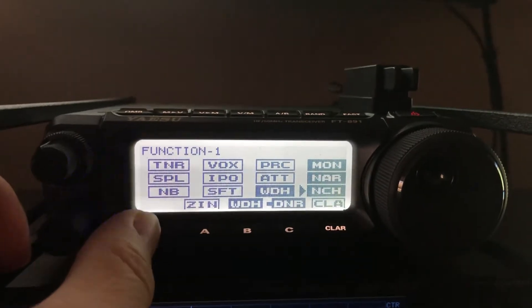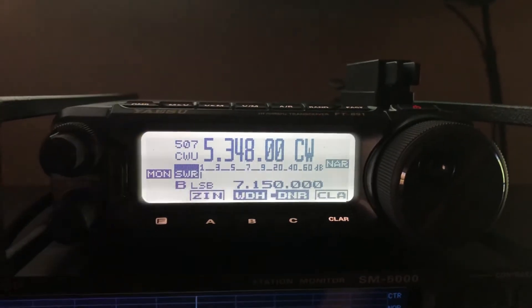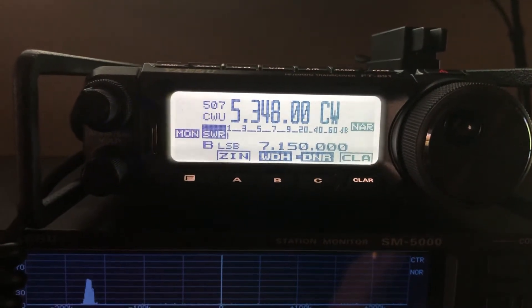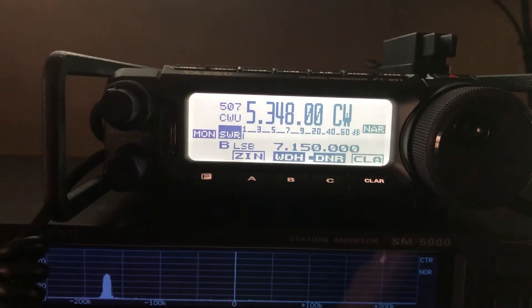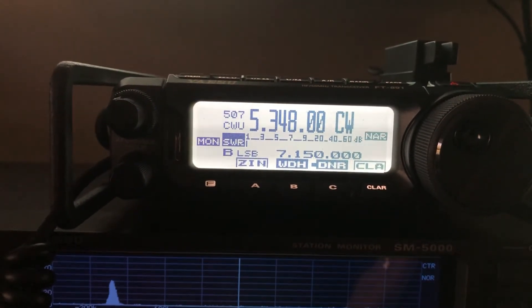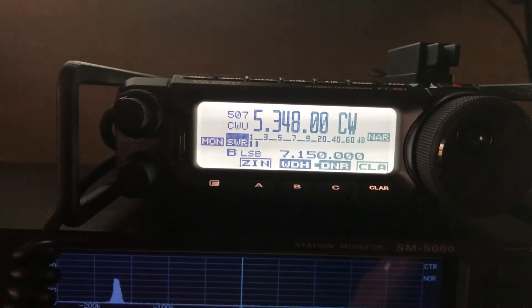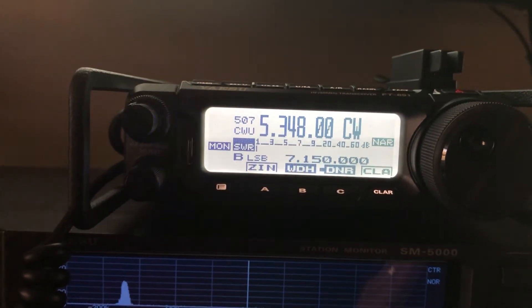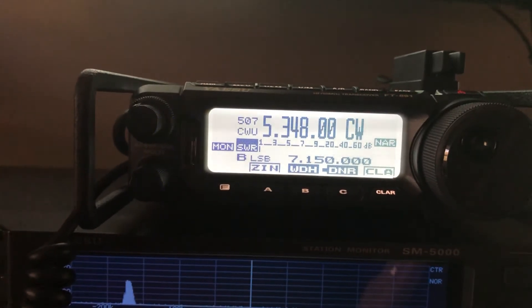Again, this is an extreme situation — this guy is just about imaginary, almost a ghost signal. Anyway, I thought I'd shoot this quick addendum video based on things I was showing you in the previous video regarding the FT-891 and CW setup. That strange noise you're hearing — remember, we share these channels. Sideband and CW: the CW is center of the channel, and the sideband is transmitting one and a half kilohertz below the center of the channel.